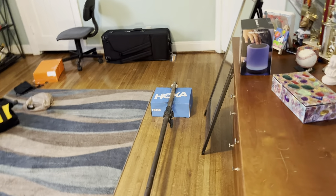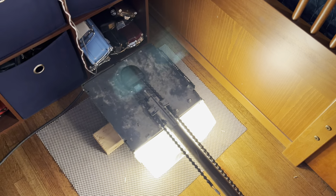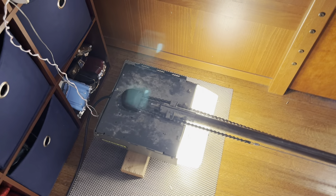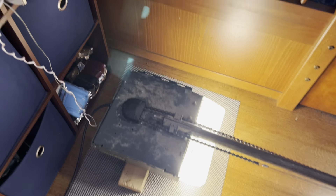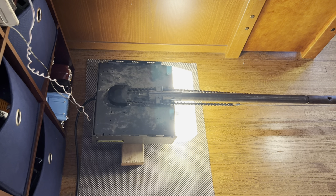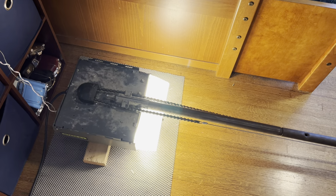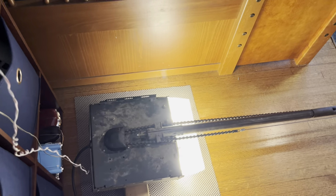So there you go — that is a full review of the Stanley ST400. Pretty simple machine, honestly, on the inside especially. There's just a motor, gear case, drives the sprocket, and then the limit adjustments are just attached to the board. There's an RPM wheel inside there as well. We'll go ahead and run this thing one more time here.